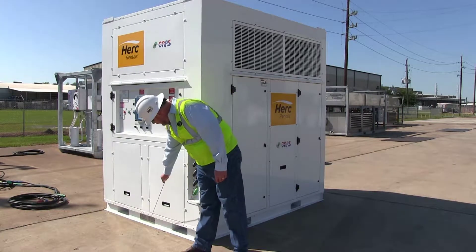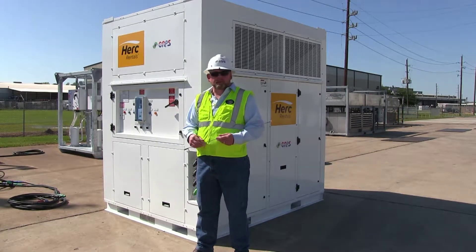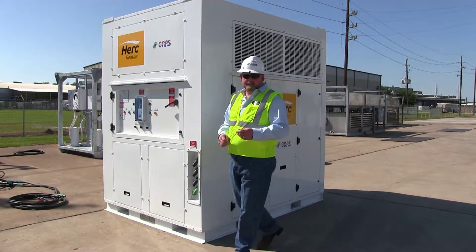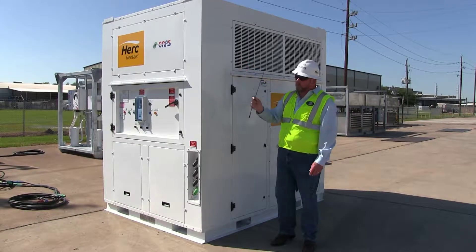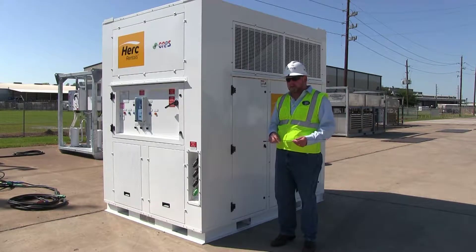Please note that the weight tag is in the bottom of the channel frame, and ensure that the forklift being used to move the machine is rated to that capacity. Over the top there are some straps, and these are intended for when the machine is being hauled, to strap the machine down to a truck trailer.